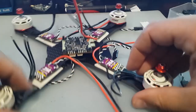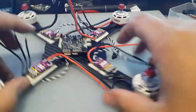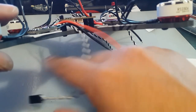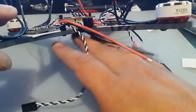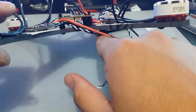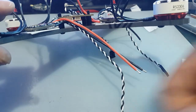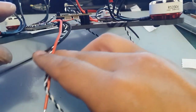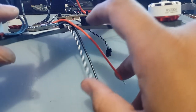the flight controller in. Now, I've used higher standoffs this time because the battery strap, almost every crash, I end up ripping it, and it's just a complete pain to actually just put a new one in. I'd have to just undo the screws, lift it up, just stick it in, use tweezers to pull it or pliers, and it's just very time consuming. So this time I'm going to go with a little bit higher standoffs.